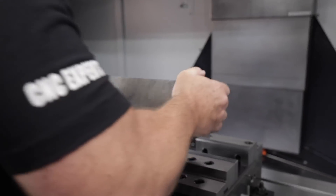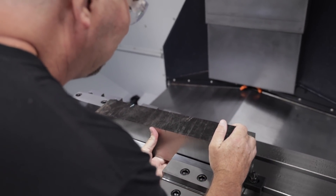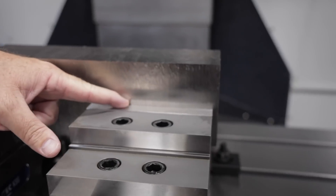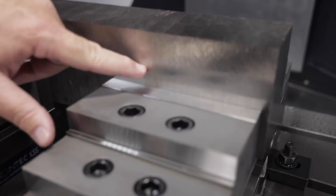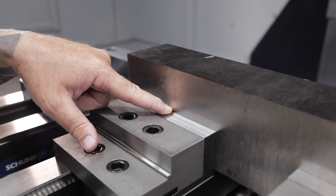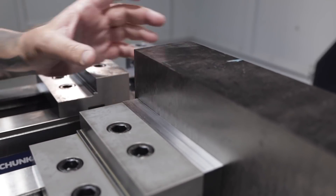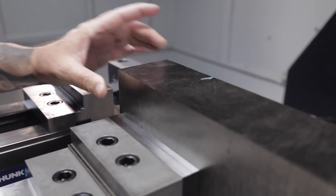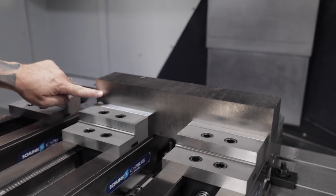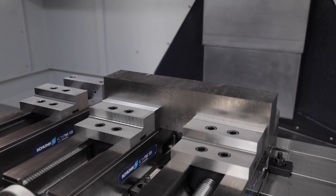So I'm going to grab it and pop it right in here. When I was talking about the inconsistency — check this out. You see how the jaw is hitting the material here, you can see a little bit of a gap over here. You come up here, you can see it's hitting, but right here it drops off. See that big gap right there? So this tells me that when we actually cut this part of it and I zero the top surface, I've got to make sure that I understand where the low spot is and where the high spot is so I can be incredibly accurate with my cut.